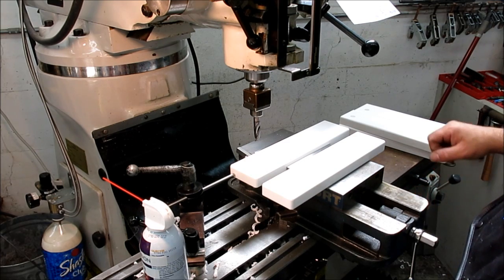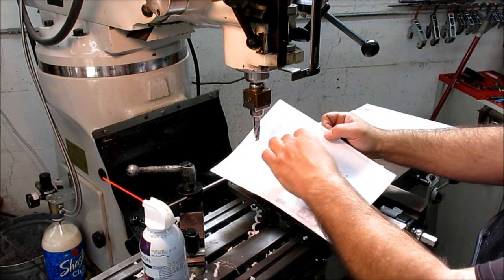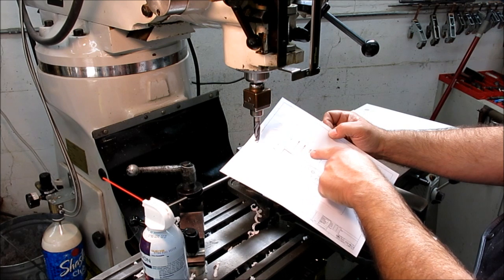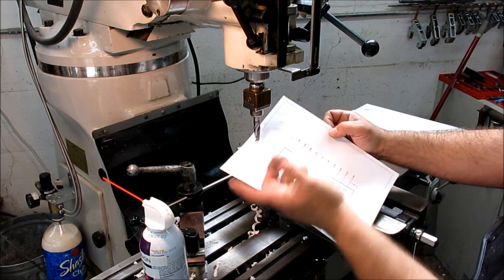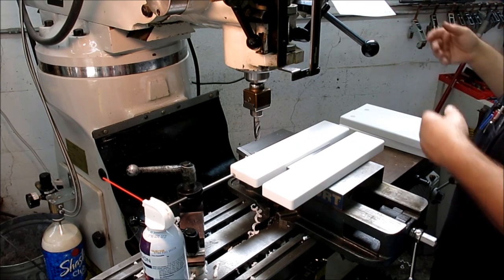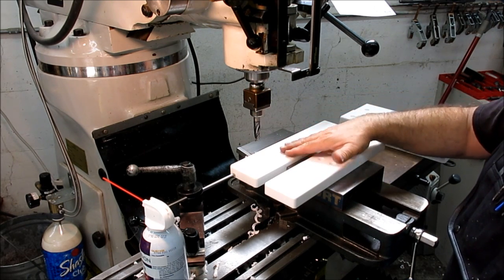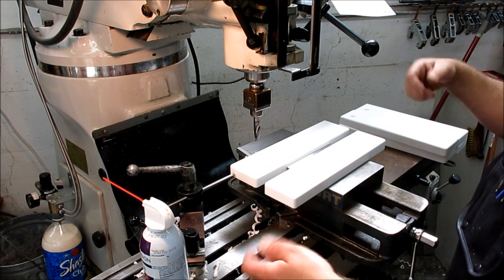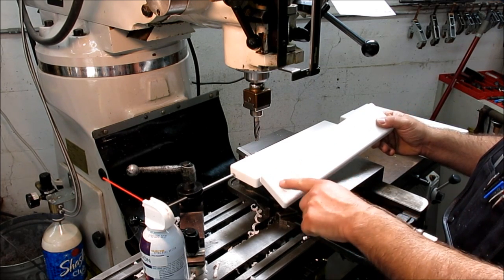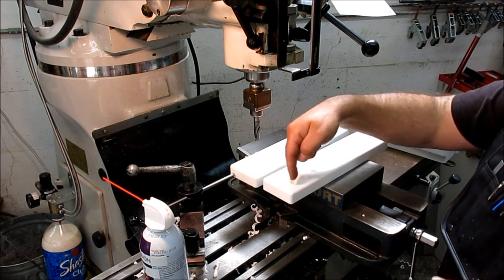Now the numbers in this particular case, I would call them slightly messy. It's an odd spacing between these. So the numbers are 2.389, 3.528, 4.667. They're what I would call messy numbers. It's not like 1 inch, 2 inch, 3 inch, 4 inch, etc. Right? So in this situation, the fastest with multiple pieces is, in this case, a very easy part change as opposed to tool change or table movement. So we'll go ahead and do a couple, and you'll get the idea. And then we'll talk about the countersink too, because that's done a little bit different way, to make them all uniform and not have to drive to each location.